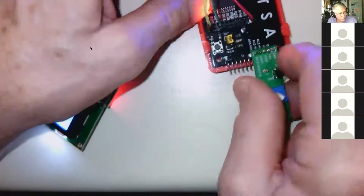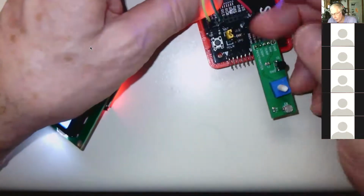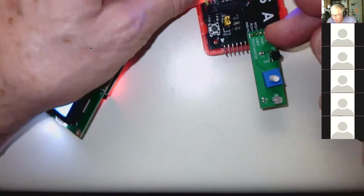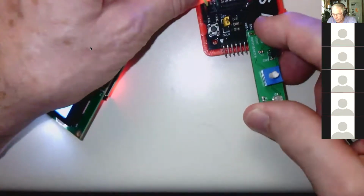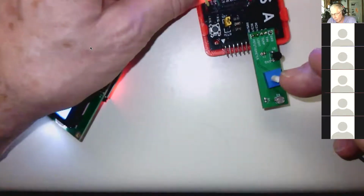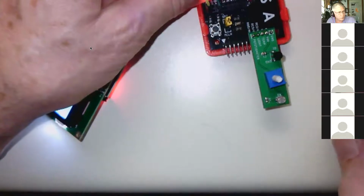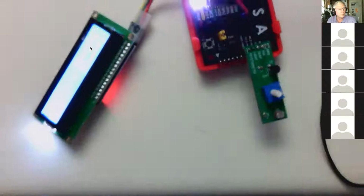Okay, we'll also give you this analog board. It plugs into the analog header right here. You can plug other things in the analog header, but this board's all set up. It has power, ground, and then it has 3 analog inputs: one for the MCP9700 temperature sensor, one for the potentiometer, and one for the photoresistor that's set up in a little bridge circuit. I'm going to stop this thing from jumping around.